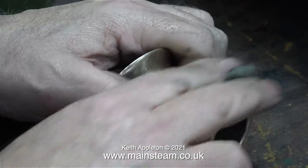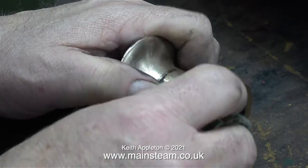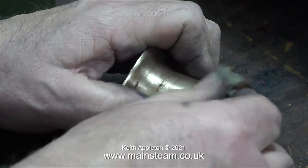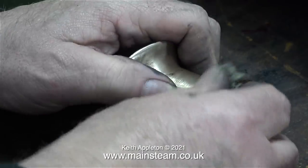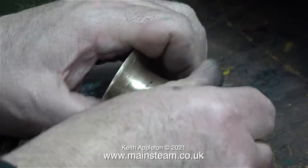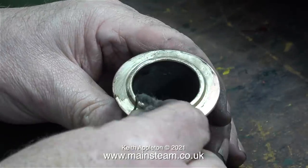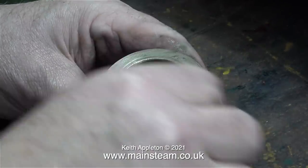After removing the chimney from the mandrel I cleaned it up using my polishing spindle followed by some Brasso wadding, then finally polished it with a piece of cloth. It looks okay but you can still see the marks. As an experiment I will have a go at electroplating it and just see how it comes out, but before I do that I'll need to remove all of the copper plating from the top side of the top cap, and for that I'll need to use the mandrel one more time.